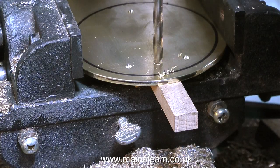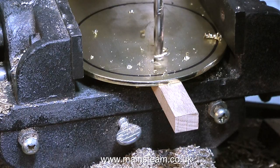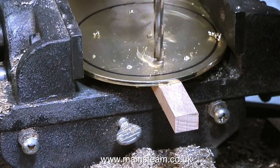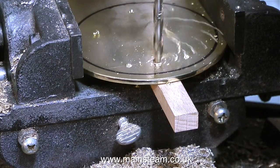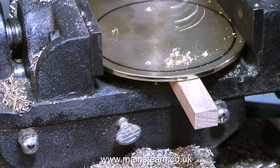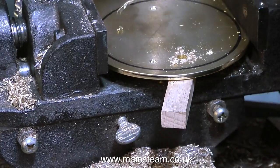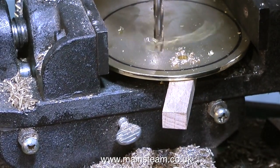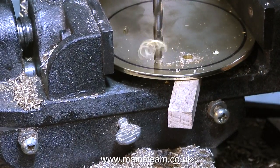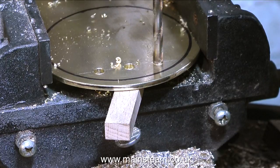I always keep the belts on the drilling machine quite slack, so if things do grab, they don't go very far. When I up the drill size — and this is a 7/32nd of an inch drill — I don't hold the piece of metal, because if this grabs the piece of brass it will spin it round. So to prevent that, I've clamped the piece of brass gently in the machine vise — a cross vise — that sits on the drill. It's a very cheap and nasty affair, but it's a good thing to have in a workshop, because anything's better than cutting your hand off.